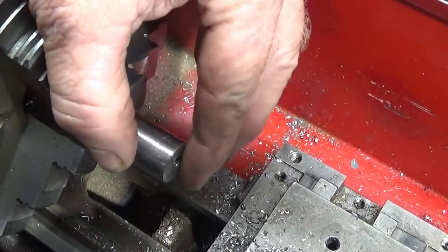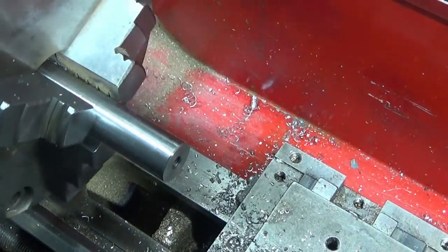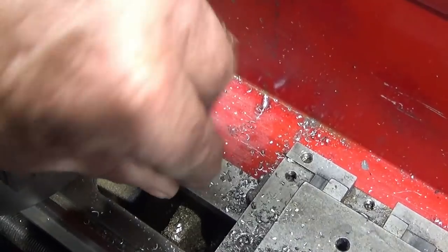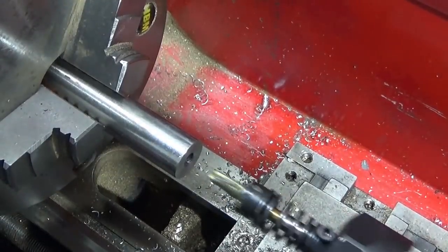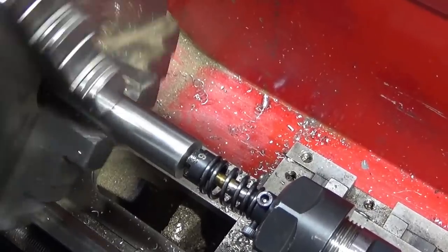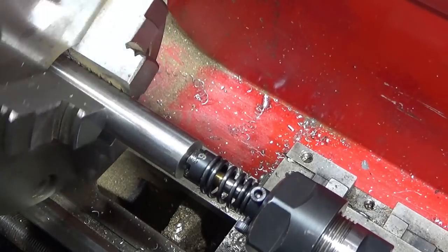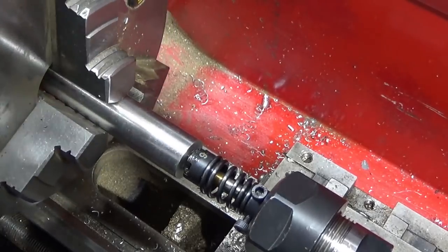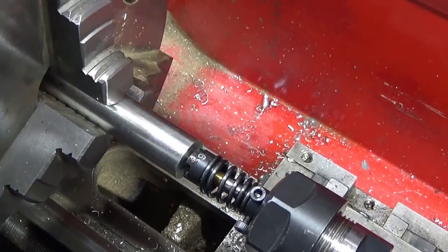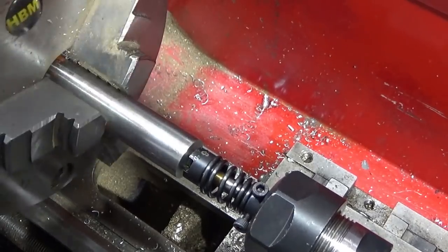That's the thread cutting done and the burr taken off the end all in one go - an absolutely excellent tool, even on stainless steel, and saves a lot of time. If you do want a larger chamfer on the end there, you can actually take it in again. When the cutter touches the front face of the work and pushes the spring back it obviously feels like it's under tension, and you have that feel with the pulley wheel or the handle if you do it manually. It does feel like the tap has gone tight but it's not - it's just the spring being pushed back.